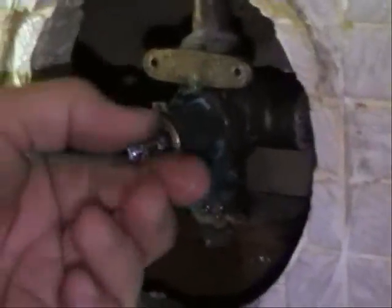this spindle piece here, if you look at it closely, has two flat sides to it. So what I'm going to do is attach a vice grip to it to try to pull it out. But first, before I do that, I'm going to remove this U-clip that you see here at the top. Alright, and that should pull straight out. There you go. Okay, give me the vice grip.